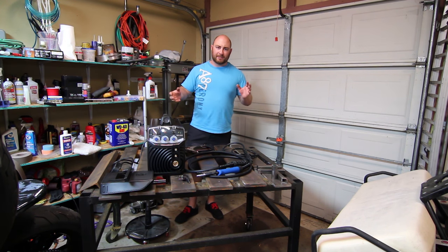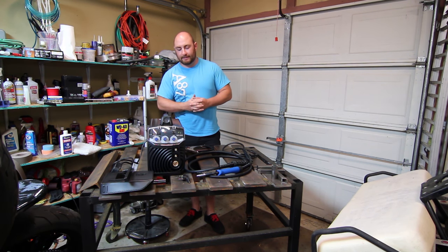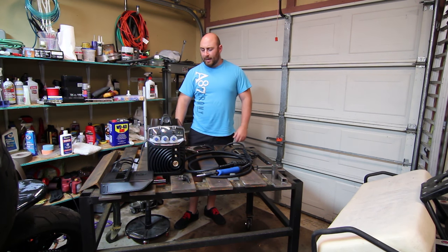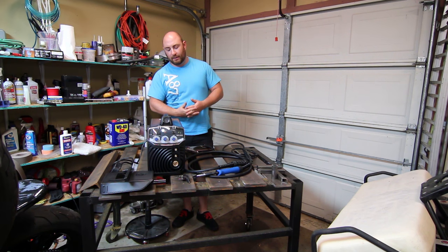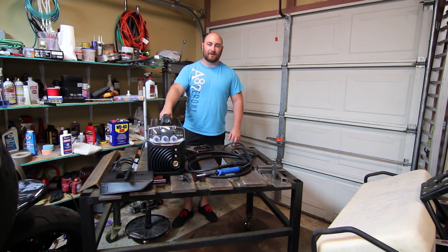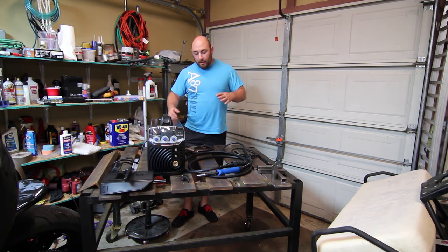This is going to be an all-encompassing review, and I'm going to be comparing it to the Everlast PowerMig — a well-known Chinese MIG machine. If you watch Chuckie2009's videos you know he's basically a walking infomercial for Everlast, and I've used several of their machines myself and they're very good. The main reason I went this direction rather than buying a name brand unit is because this thing has a whopping 100% duty cycle at 195 amps and a 60% duty cycle at 250 amps. I couldn't find anything for less than $1,200 to $1,300 from a better-known brand like Everlast or AHP that could do this.